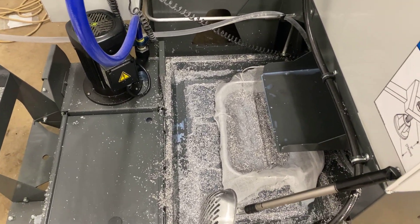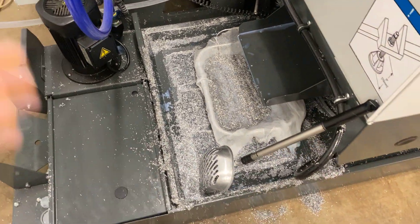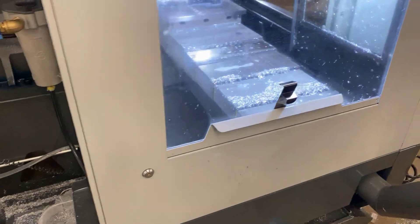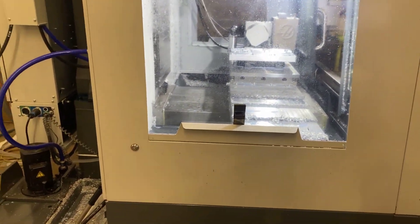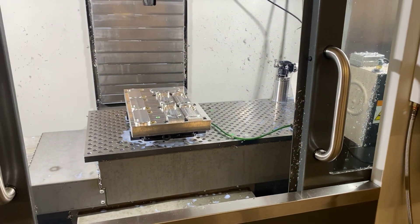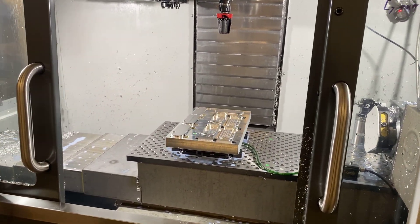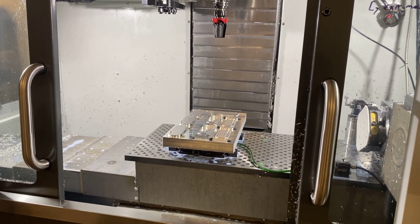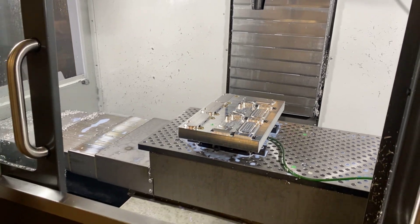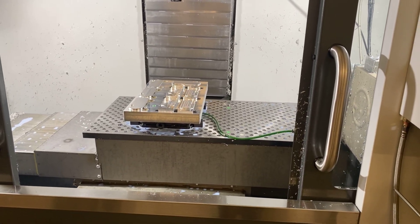But there are other things that are a lot harder to automate, like these little bins that collect your fines. Those will plug off, then this will start filling up with chips, and that can actually run coolant over the edge — which I have had happen. So there are going to have to be sensors feeding back to the robot for that. There's also going to be a universal low-air-pressure emergency stop, which technically the Haas has. So if you tie your e-stops together, the robot and the Haas shouldn't do anything — just sit and wait for me to correct the issue. I'm not sure what the fault correction is on the robot arm when things error out, so I may have to come up with some kind of routine for that.